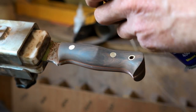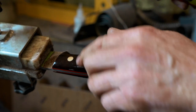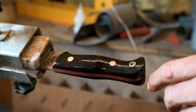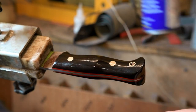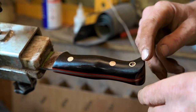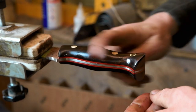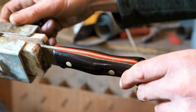Let's do a quick spray of WD-40 and you'll see how the wood darkens down — it reveals the grain to me and it also reveals any potential flaws. There's a little bit there I've got to sand back a bit more. You've really got to finish off on the coarse grit before you move up — get rid of all the previous grit scratches before you move up to a finer grit, otherwise it just takes so much longer. This side's a lot better, just a few little marks in there, so we've got a bit more sanding on the 240 to go yet.